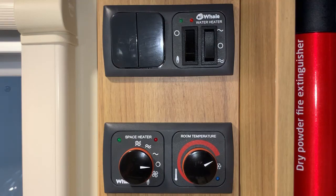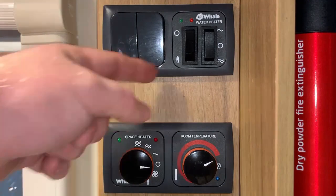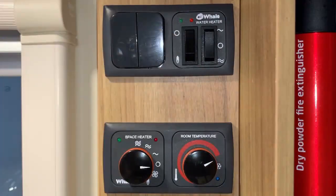Refer to your manual — some hot water systems do work fine using both energy sources at once, because you can combine the power of both systems to really get things hot nice and quickly. But if you're unsure, you can just use one or the other. Typically, though not always the case, the gas is the more powerful of the two — probably three or maybe four kilowatt, whereas the electric may only be two kilowatt at absolute maximum.